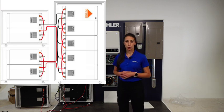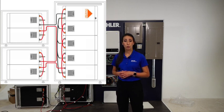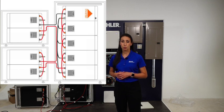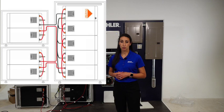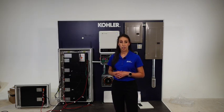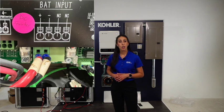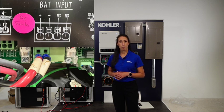Note that the order in which these are connected is important. For the 20 kilowatt hour system, the correct order of installation of the power cable is to begin at module number one right below the BMS and finish at module number eight, which is the top module in the upper expansion enclosure. Note that the connector colors must always match when wiring the cables — red with red and black with black. The batteries connect in series with each other. Begin to wire the batteries together from positive to negative in series. Route the final negative wire from the last battery on the last enclosure to the negative of the BMS on the main enclosure. Next, connect the battery bank to the inverter. Route cables through conduit openings and connect the long positive red and negative black ferrule ends of the battery cable to the inverter positive and negative battery input. Plug in the long positive and negative cables into the same color BMS connectors.